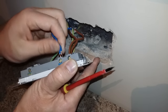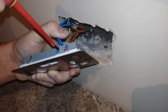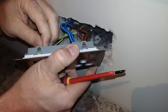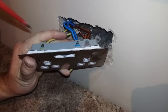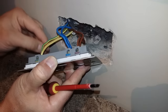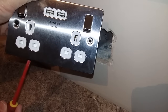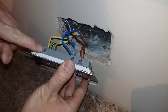Take the neutral and do the same — push them home, do the screw up, ensuring there's no bare wire showing. Now with the earth, we've got the two off the wires — in there, like so. Do the screw up, holding the wires in place, nice and tight. We've got this one final wire — there's another terminal at the bottom, and we can do that from underneath. So the earths are all going to earth, the blue neutral goes to neutral, and the brown live goes to live.